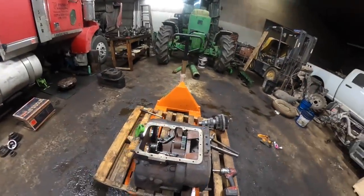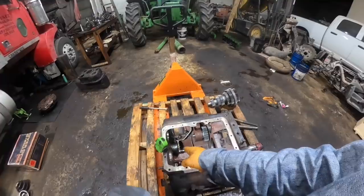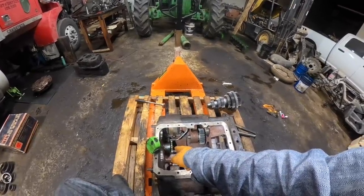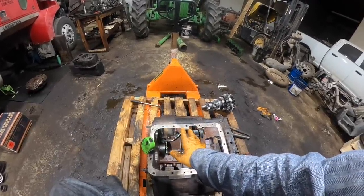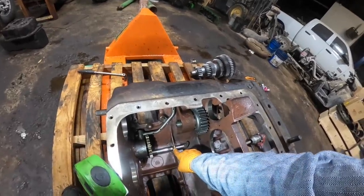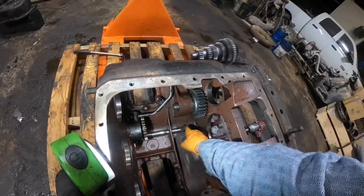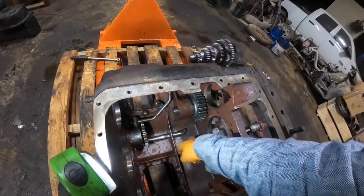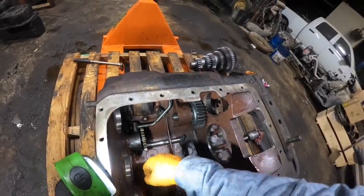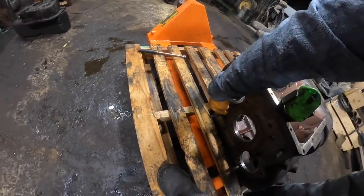The case is half cleaned up. New gears were installed inside the oil pump — an internal and external gear, it's an internal gear pump. This little tab will bend up on the suction tube. Bend that tab up, pop the suction tube out — you have to twist and angle it out. There's a new O-ring in the kit; put a new O-ring on the suction tube.